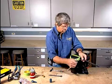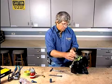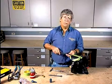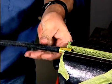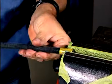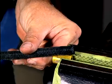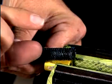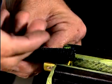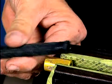So let's take this hose end off here now. We're going to turn it around in the vise. And this is a reverse thread — so if you go to install this thing, it's just going to be like we're tightening this in order to get that back out. And you can see the threads that are threaded onto the outer portion. It is the inside and the outside of that body that are actually squeezing that rubber in place that holds the hose from coming out.